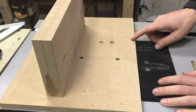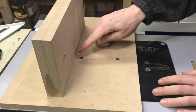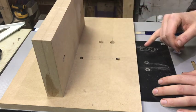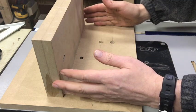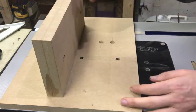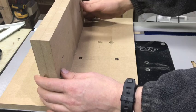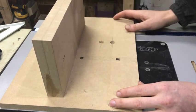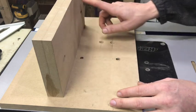Now I'm about ready to make my last pass here, and I'm only going to go a little bit of a ways, maybe half the bit into the back of this, as when we initially line up our front plate, we'll then go all the way back through. Over time, this tends to, due to overpulls, keep going back further and further, and we don't want to go too deep in there initially and weaken this at all before we get this front piece put on.